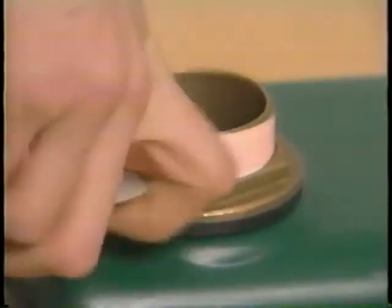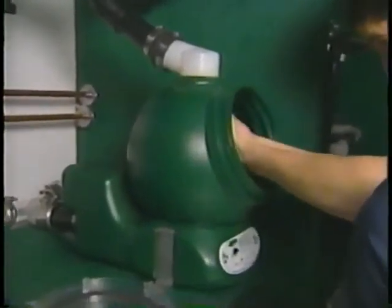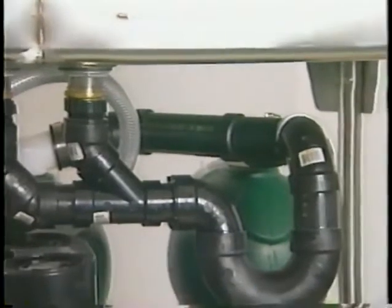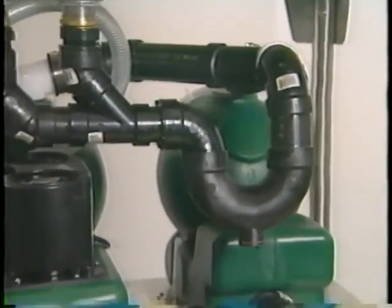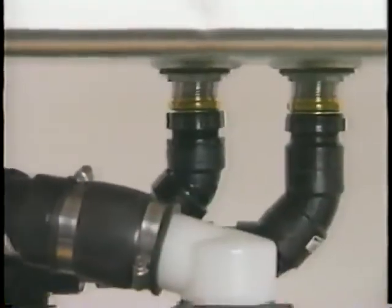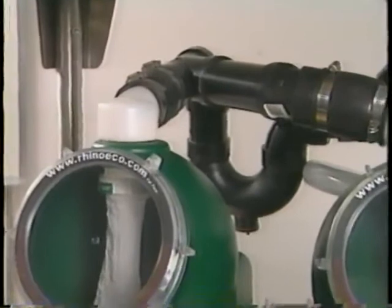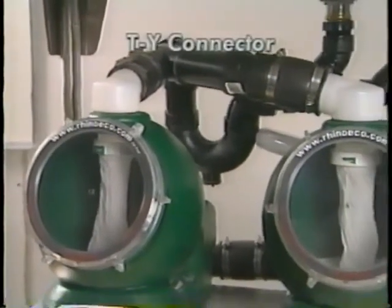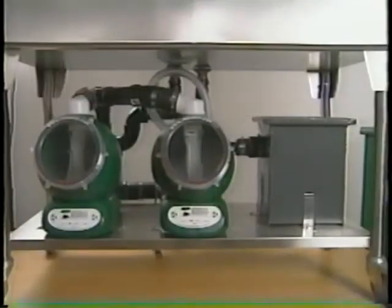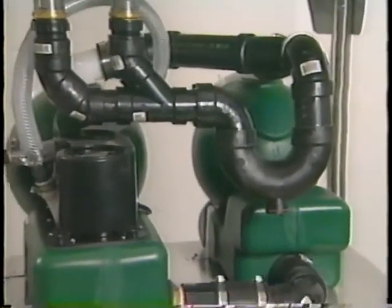Wrap the fitting with Teflon tape. The initial installation steps for both units are relatively the same as the installation of a single gravity unit. After you've connected into the sink outlet immediately downstream from the P-trap, direct the piping toward both inlet ports — first to the gravity unit, making sure the top inlet connections are securely in place. Then with a TY connector, direct another length of piping toward the pump unit entry port, again securing all inlet connections. When done this way, wastewater from the sinks will flow into both units.